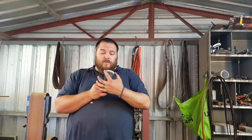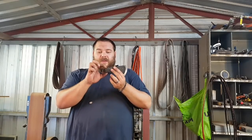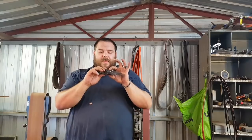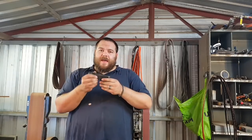7.5 centimeter long blade. It's 140 millimeters long. It's got a 35 mil square pole, and it is 35 millimeters thick at the eye, tapering straight down. Rather than tapering in sharply, it tapers as a long, slow taper, which makes it quite a hefty axe.